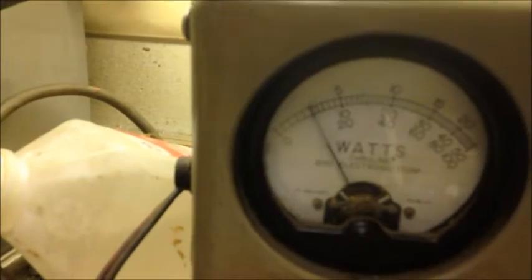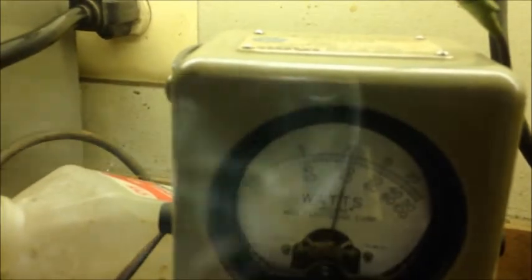We're dead keying about 7, maybe 8 watts, so we can swing up to about 15. That's at dead key. We'll talk back — about 20 is usually a safe zone. Let's drop the dead key to where we get the most modulation. Run a little 1kHz tone and throw it through.